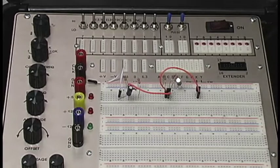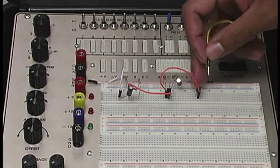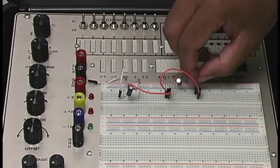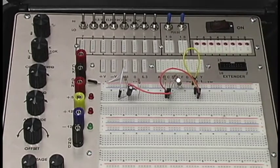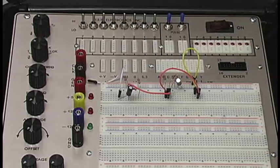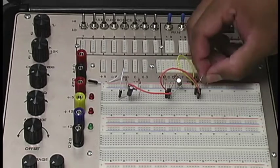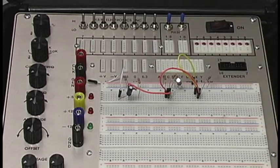And looking at the circuit, we now see that our collector pin from our second BJT is going straight to a 12 volt DC power source. So that means that I'll just put it on the same row as the collector with this wire here that has no resistance, obviously, virtually anyway. Straight to our power source strip right there. And then I'll take now our emitter pin going with a 1K resistance, which is easy enough, just 1K resistor right here, into our grounded DC source, okay, to the ground, which is essentially 0 voltage. Okay.